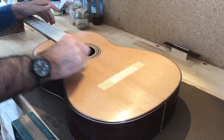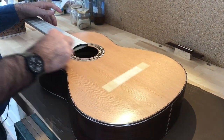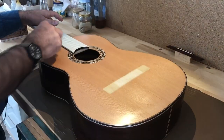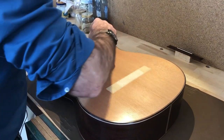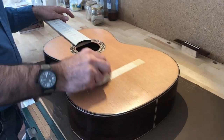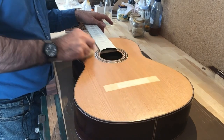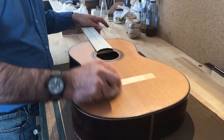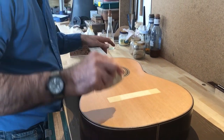So first, what I want to do is, without applying too much pressure, just quite gently, I want to spread the oil everywhere. And you can now start doing circles, as well as big 8s, or also just long strokes along the grain. But in that case, you always need to come out, don't stop to then lift up.